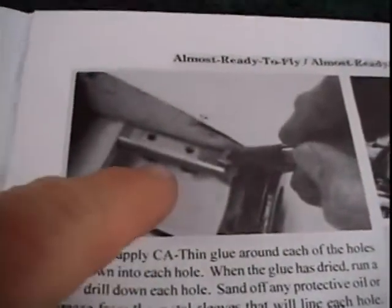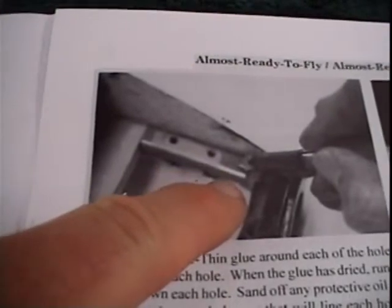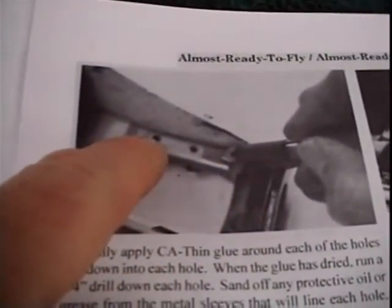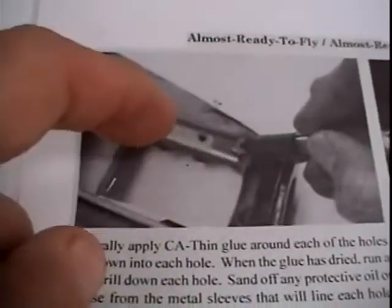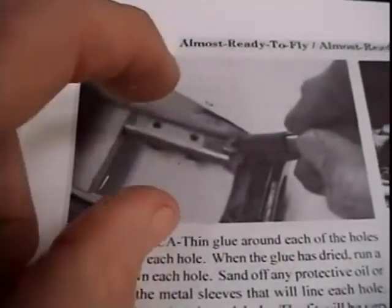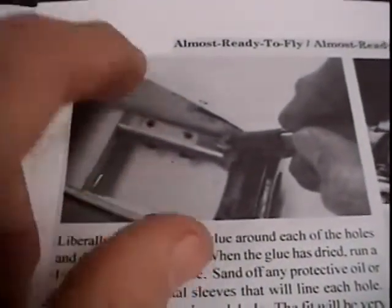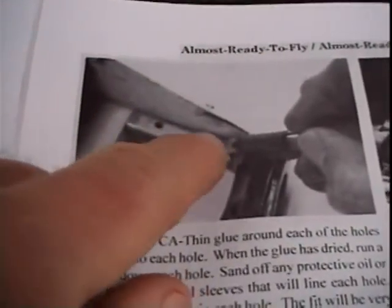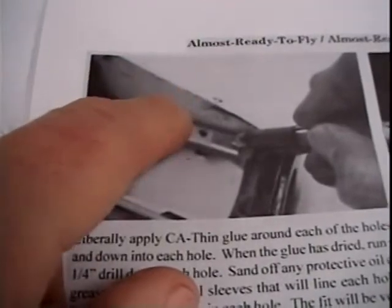Also, another way to deal with this would be, because that little hatch comes off the top, if you are having trouble with the motor mounts sinking, the blind nuts sinking in, because don't forget this is just like clamp mounts. You could always put a set of aluminum pads on top and thread them, or make steel pads. That would be another way to do this.